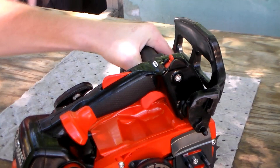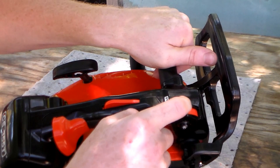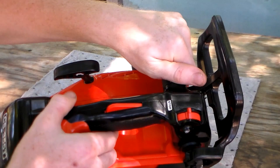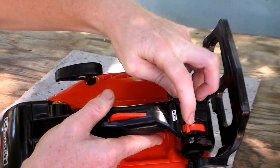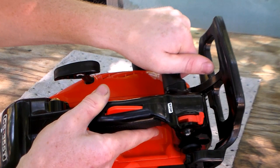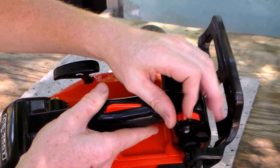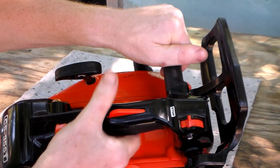The combination switch goes: all the way forward for choke, then fast idle or run, and off. One thing I noticed is when turning the saw off, you don't have to pull it all the way back — just pull it back slightly to get some tension, enough to turn the saw off and let the switch return to neutral. For cold start, use full choke. To restart when hot, pull the cord back once to set fast idle, then depress the trigger to set normal idle.